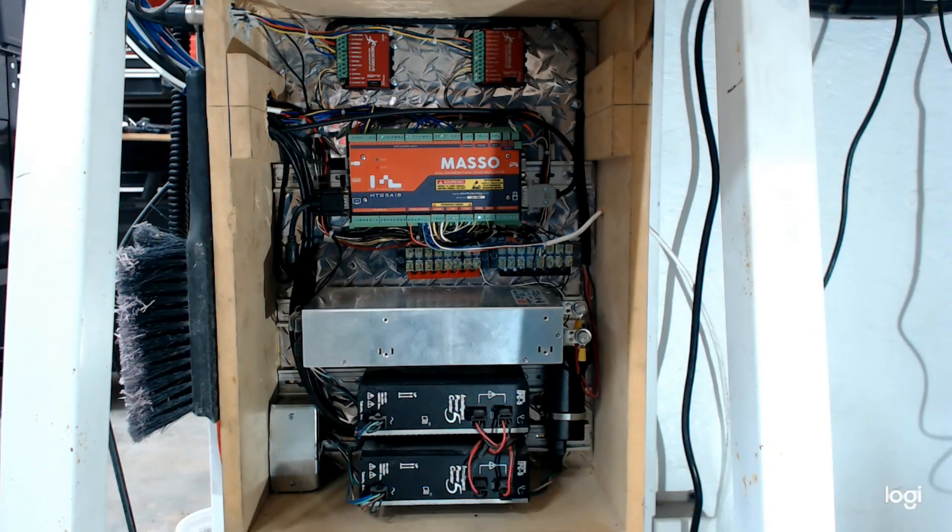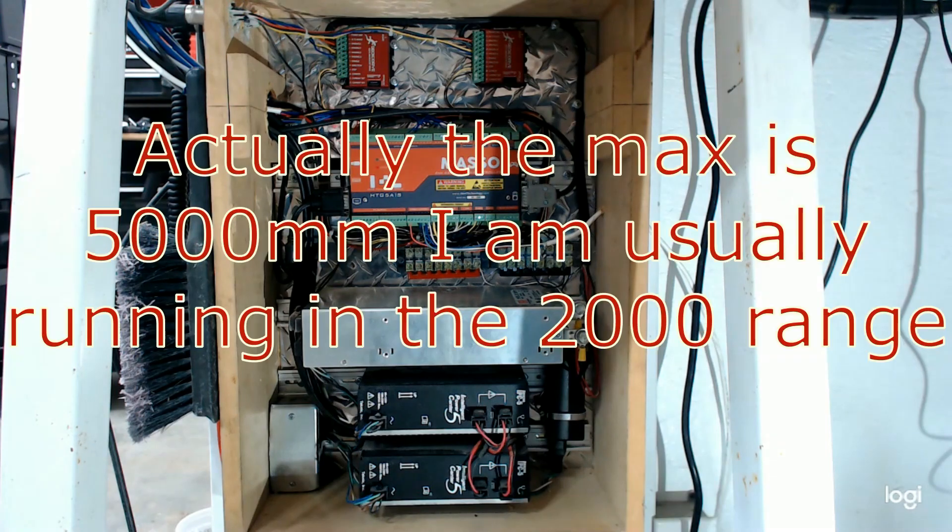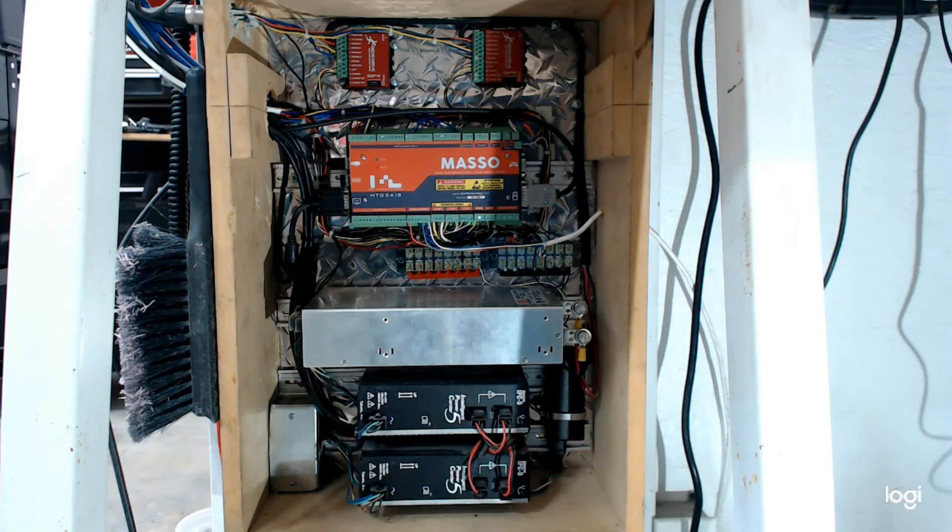What were those conclusions? Starting with the Windows-based machine: Mach runs on Windows, and that is not a real-time processing system — it's a parallel processing system, which means it can take on other tasks. The thought was that at the speeds I'm running, in excess of 5,000 millimeters a minute, we could be introducing latency, causing it not to stop in time and resulting in loss of steps. The other problem was the drives themselves — I was using NEMA 34s, and stepper motors lose torque as they go faster. So I switched to Clearpath motors and this Masso unit. The Masso is very simple: there's no PC, everything connects directly to it, making it very clean and easy to troubleshoot. The Clearpath motors are also very straightforward — they're in stepper mode but they actually hold position no matter how fast you run them.